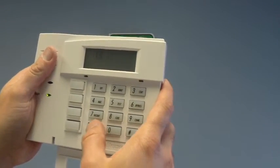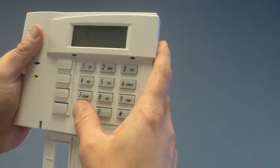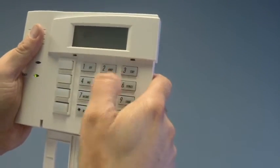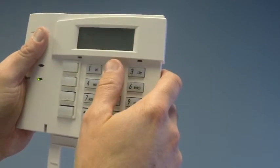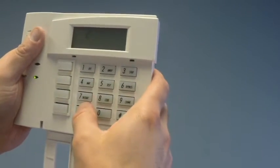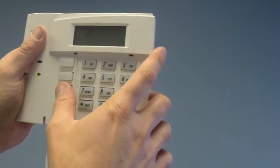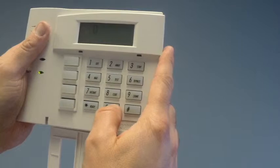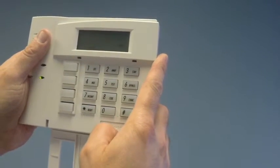You're going to press star, you're going to set 2 as 2, star, 3 will be a 4, star, 5 will be a 2. And 6 — this is the field for the panic buttons on the side here. I'd like to activate them by pressing zero, star, star, and that's it.